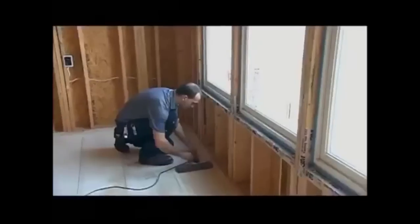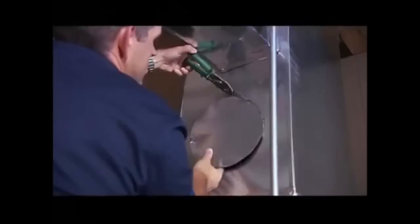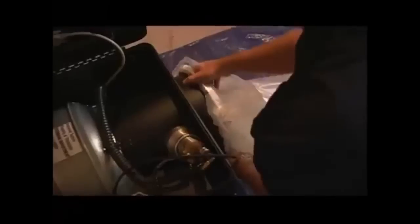So how do you get started? Well, first thing we're going to do is plug all the vents in the house, which is what we are doing right now. Next we're going to bring all our equipment downstairs, cut a couple holes in the duct system — one on the supply, one on the return. That's how we tap in our equipment. Over there is our machine that's set up, called the home seal machine. That's what we use to inject the sealant into the system.